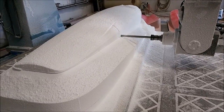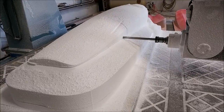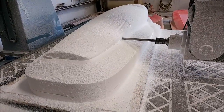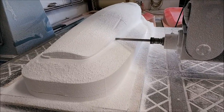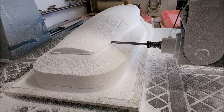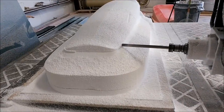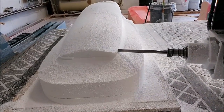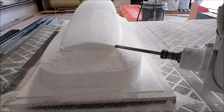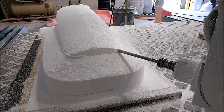Here we are a little bit further along with the air intake — you can really see it taking shape now. This path here is just running a swarf cut at the transition from the flange to the part. I run that to give a nice smooth clean transition, because when you just run the face cuts it doesn't always cut right down to the edge. The swarf cut actually runs right along the transition line — basically a cut where you run right along an edge.